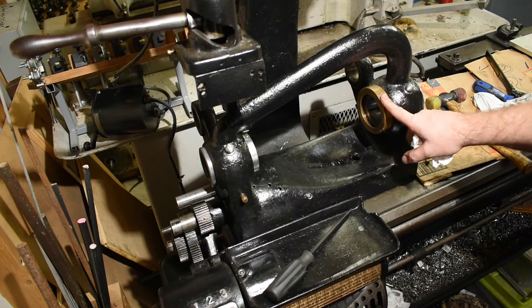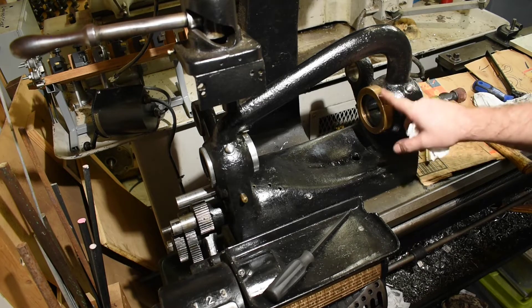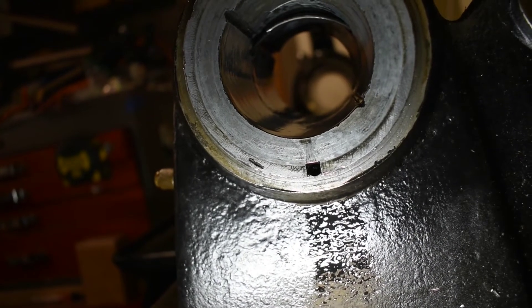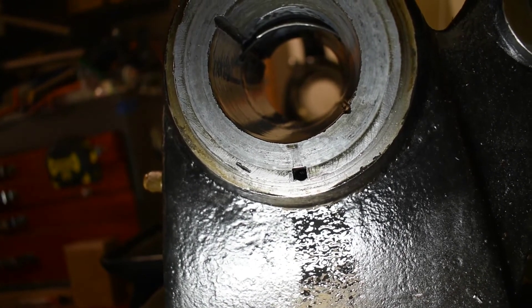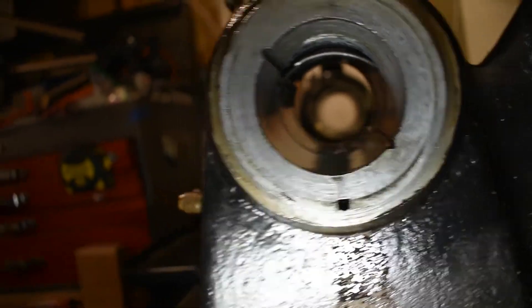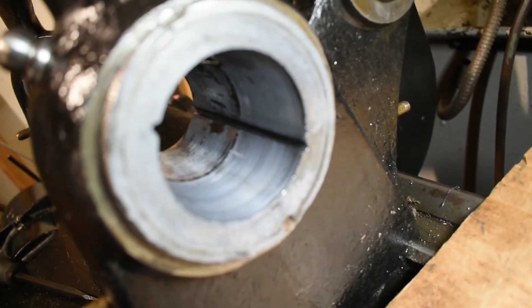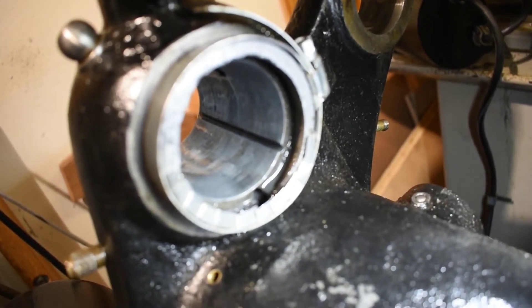And here's that ring I was talking about that sometimes sticks. Next, there's another brass ring that can be removed. And if you want to clean the oiling system really well, you're going to want to remove it because there's a drain-back hole in the bottom. This is the front of the front bearing — the inboard bearing — and there's a little hole in there that allows oil to flow back into the reservoir. There's one on the back as well under that other brass ring. These are the spindle bearings on the Hendey, and you want to be really careful not to damage them — there are no replacements out there. This is the back one; it looks a little worse than the front and you can see it's got some wear on the bottom.